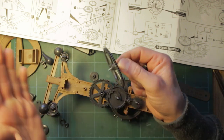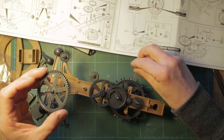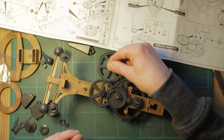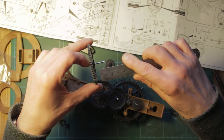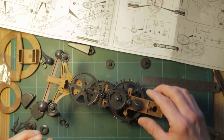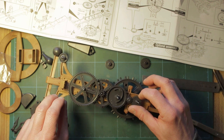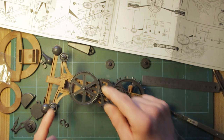And then the other option, which just makes more sense to me, is D1, which is a 60-to-1 ratio, and very obviously, there's 60 minutes in an hour. You use the jig as previously, and then the last 31 millimeter shaft, press that down, and that gives you the perfect alignment, leaving 18 millimeters protruding from the top. That then sits like so. And that gives you your standard 60-to-1 ratio. As I say, this personally to me makes more sense. So I'm going with that one.